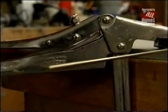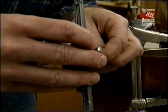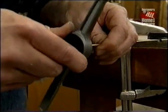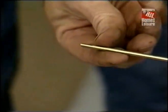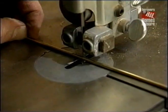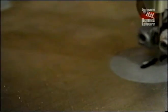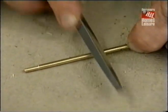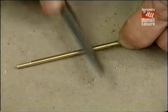Now I'm ready to start building some shafts. You can see that the shaft runs through the pulley and some sleeves so that it can spin freely, and nuts hold them in place. The material I'm using for the shaft is 1/8-inch solid brass bar that I picked up at a hobby shop, and the sleeve is just a hollow tube that slides over it easily. Now the rod comes without thread, so I'm cutting my own using a die. They come in various sizes and various thread patterns. The idea is to just carefully start it on the end and make about a quarter turn forward, then back it off to remove the chips until I thread the right amount.